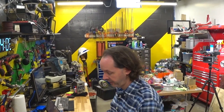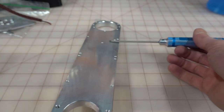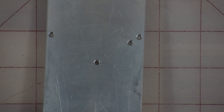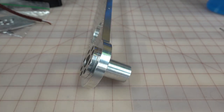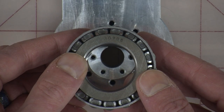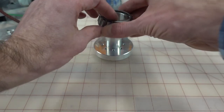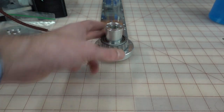That's what you should end up with — it should look like this. As you come down the arm, you'll see our two holes for the limit switch mount right there, facing down. We got an arm! Next, we're going to grab one of our 30206 bearings, flip it over so it cones up, and just drop that right on there — it should perfectly fit. Boom, like a glove.